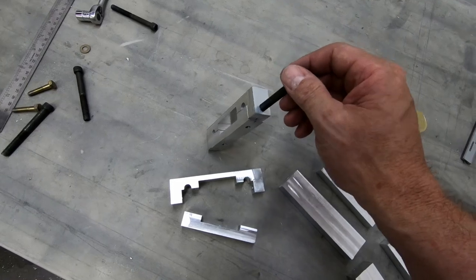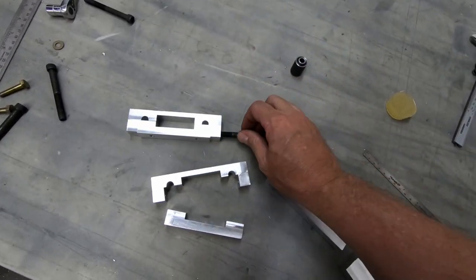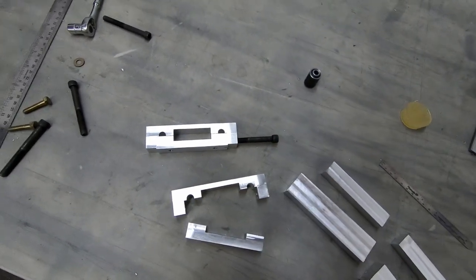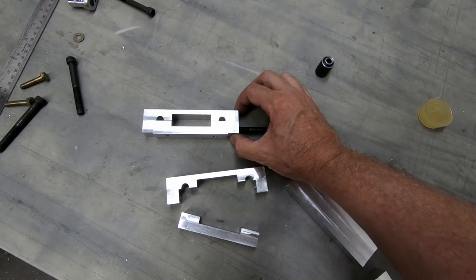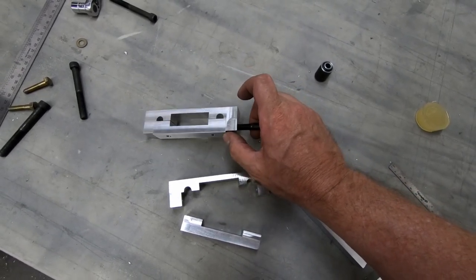It's about 3.75 millimeters, and it really should be 5 millimeters. So that's actually what it is from this edge here inside where the threads are. It's got the 5 millimeter, but here it's close to 2 millimeters or even a little bit more short.